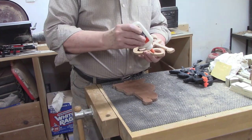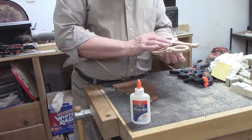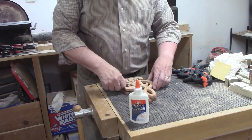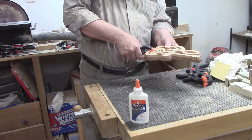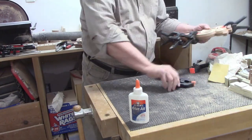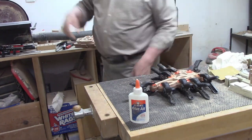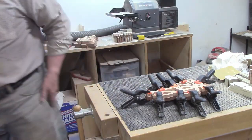Many of my projects involve gluing small parts together, and for them I find this little glue bottle invaluable. It once held Elmer's glue, but once that was gone, I kept refilling it with white glue purchased in gallon bottles. I can squeeze out glue in small beads through this spout, then use my fingertip to spread it around. There are a lot of little areas in between the cutouts that needed glue for this to be a good glue up. I spread glue onto these areas and was careful to get glue close to the edges so the top and backer would stick together well. Once I had the glue distributed to my satisfaction, I grabbed some spring clamps. When you first apply glue, the surfaces are slippery and may want to move around, so you have to apply clamps carefully to ensure the parts don't get out of alignment. Spring clamps apply downward pressure and pieces don't usually move laterally. When you use F clamps, the screw tightening can move parts out of alignment if you aren't careful.